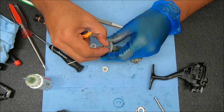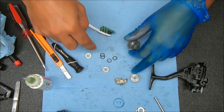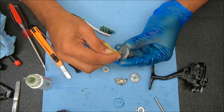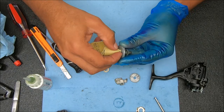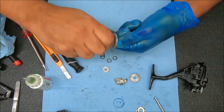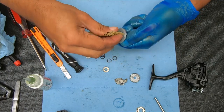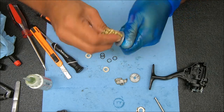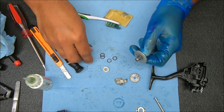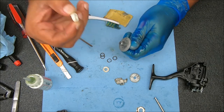So basically what I'm going to do here is just kind of work that metal down a little bit and see how it feels inside these bushings. I popped all these things off. Essentially what I'm going to do is take some 600 grit sandpaper — you can go lower than that if you want to — and get as close to the bottom as possible and just kind of work that out. I'm trying to reduce the size so that it fits inside that bushing really nicely.